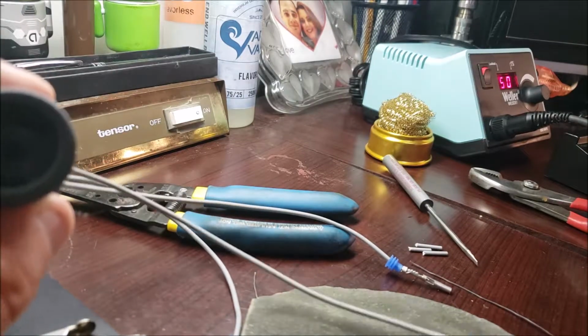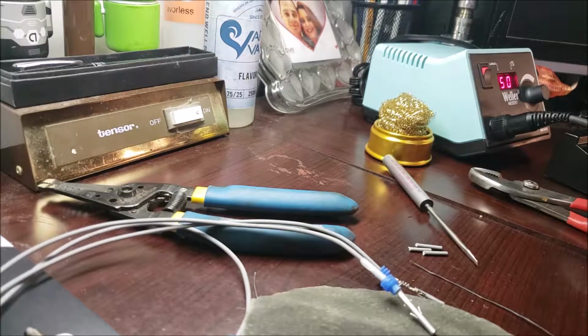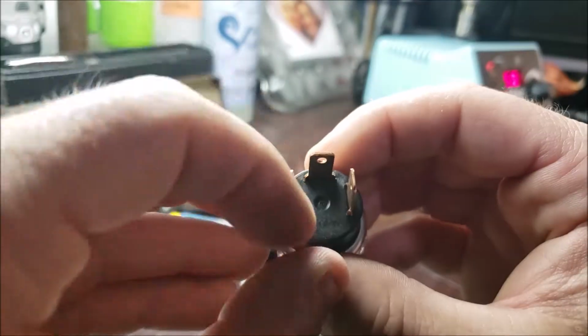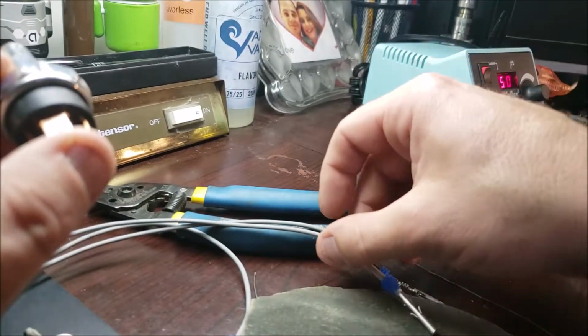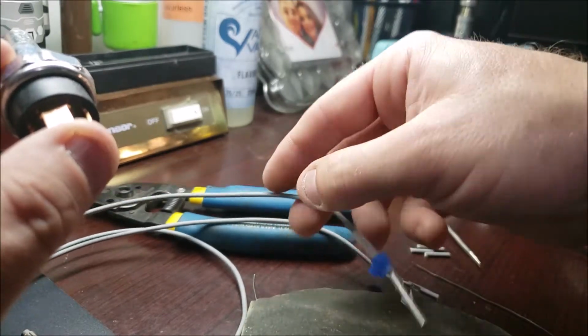So, depending on what kind of switch you may be wiring this for, sometimes the terminals are marked, sometimes they're not. Either in my other video or part of this video, I'll show some of the other types of pressure sensors that you can use, and you'll see that they're a little bit different. You know, which terminal does what and how they're labeled. But that middle one's S, so I think it's a good idea to make yourself some masking tape, put S on there just so you remember.